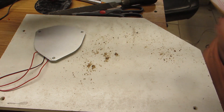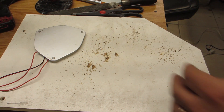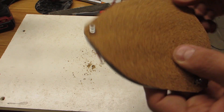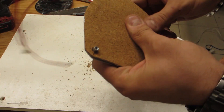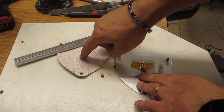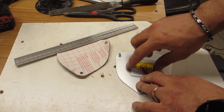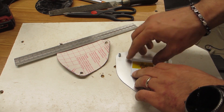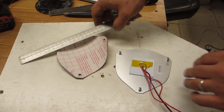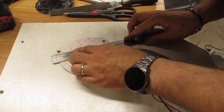I'm not sure if this is going to interfere with the actual end stops or the bed leveling stops. Installing it like so, I want to test it out. It seems like the interference point is the cork against the bottom of the heater — the actual sides and surface do not seem to interfere. So I pressed it on and I'm going to mark those slight indentations.